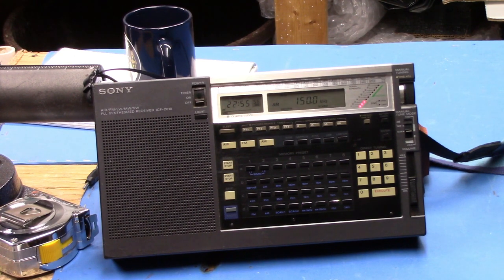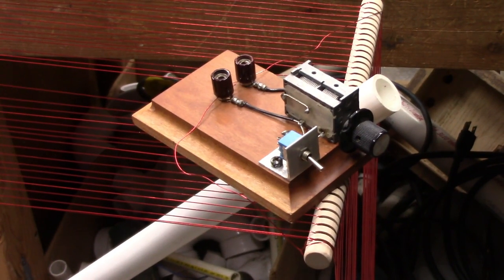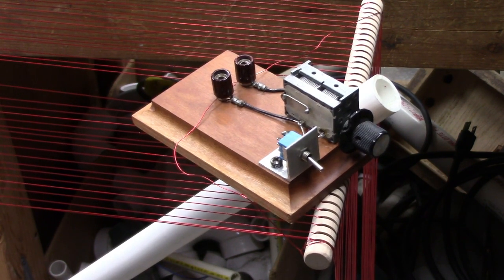What do we know so far? I'm not going to write all this down, but maybe somebody out there could grab a pencil and paper and do this. Quarter inch. Let me refocus here. Okay, so quarter inch spacing on the turns, 30 turns, 34 inches in diameter or on each leg times 4. So figure out how much wire that is, and then I'm going to give you the numbers that I get in our actual testing here. Let me turn that down. Last time I made a video with that thing going, it was way, way too loud.